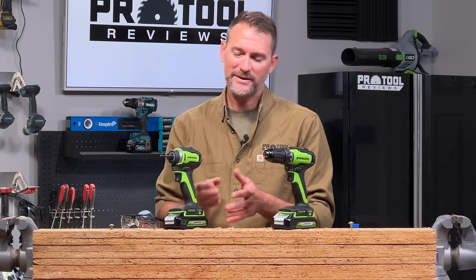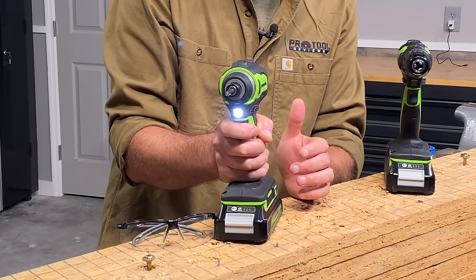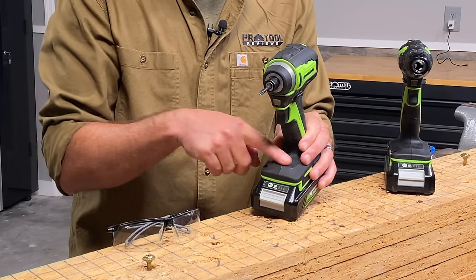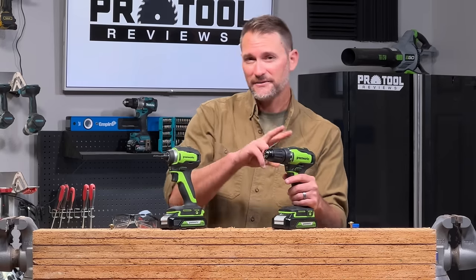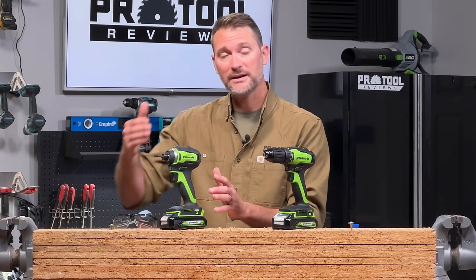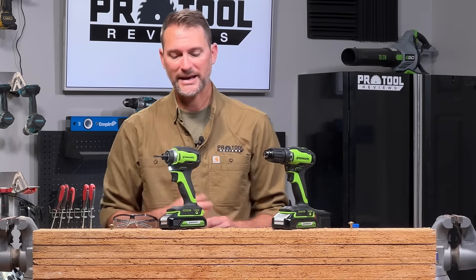You might think that seemed like it drove kind of slow — I actually had that impact driver at about half speed, maybe even one-third speed, by feathering the trigger. The trigger on impact drivers is variable speed: the more you pull it, the faster it gets. Most impact drivers also have multiple speeds. On a multi-speed impact driver, it's different from a drill — on a drill, power and speed are inverse, but on an impact driver it's reversed: the faster the speed, the more power you get. So for the most power, pull that trigger all the way down and put it in high speed.